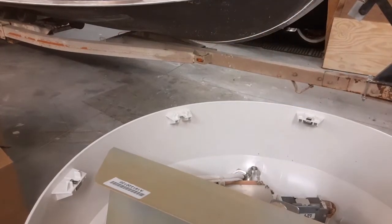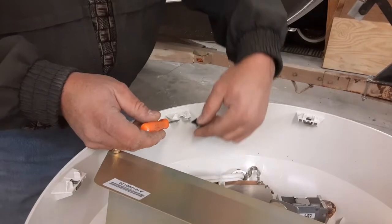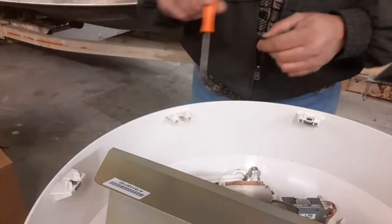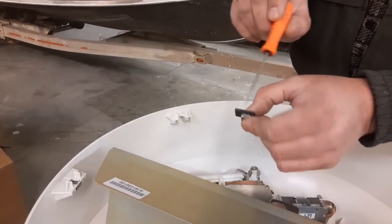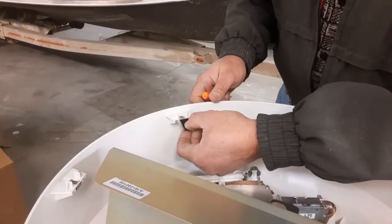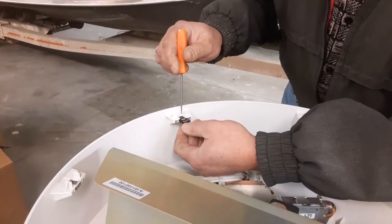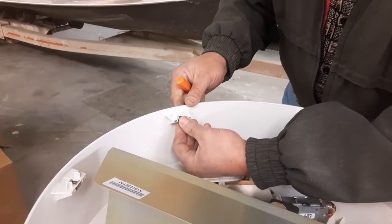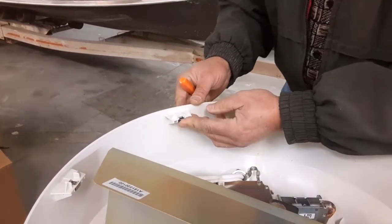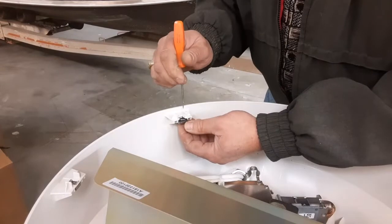What they want you to do is come in from the underside of the affected fastener location. You slide this in because there are reinforcements here and here, and it will be like an interference fit against it. So we come up from the bottom. I've also got a crack running right through here that broke when this broke. It's going to open that crack up just a little bit, but you slide her into place just like that. It lines up between these two so you can get your through bolt through when the lid goes on.